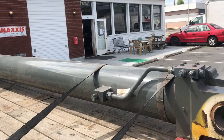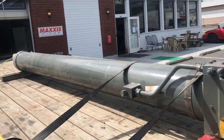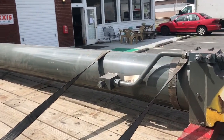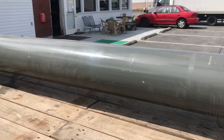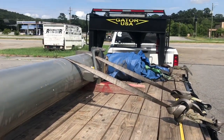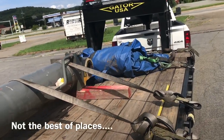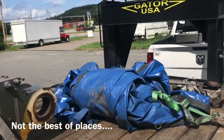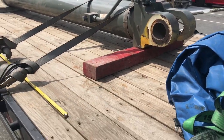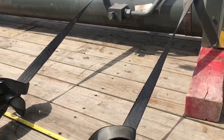What I want you to notice about everything is, if this two-ton hydraulic ram breaks free, I want you to see exactly where it's going — straight up into the front of that truck. It's going in the cab, it's going in the back of that cab. So I want to explain to you the relevance of what's known as a belly wrap.